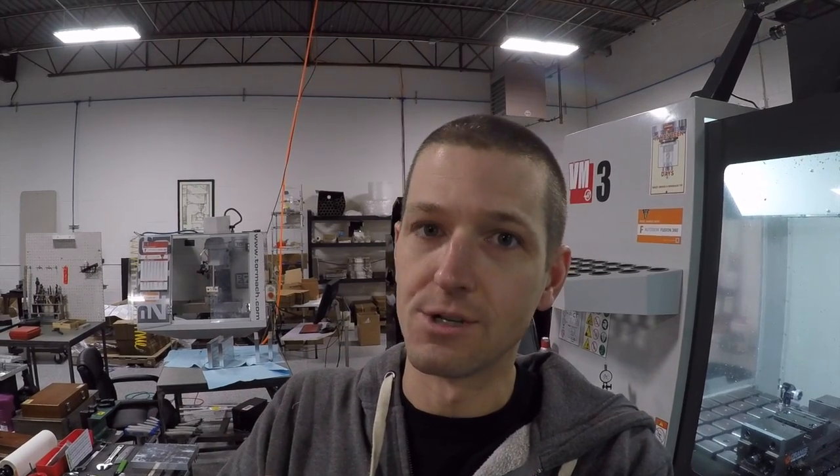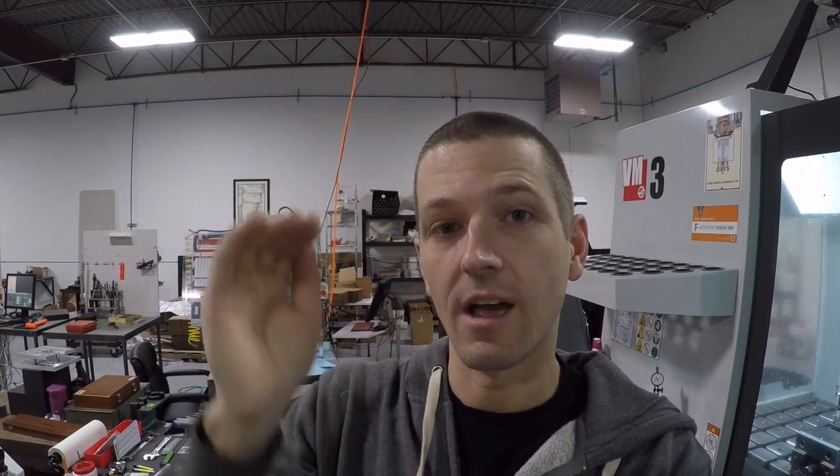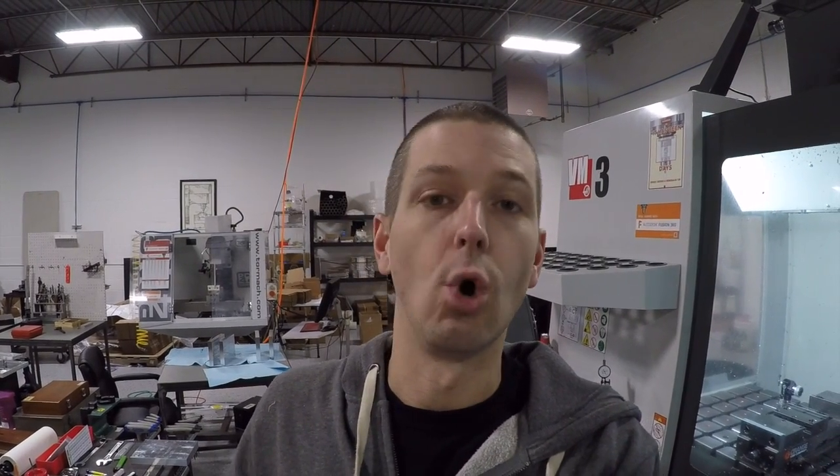Conventional machining — holy cow. This is like 101. This one I should have known; I did know, I just didn't think of it. There's a good video I found that you should all watch. If there's one thing I want you to do, hit pause and go watch the Sandvik video on thick-to-thin cutting and why you need to get underneath to let that cutter cut when you first take a cut. It's something we talk a lot about in our training classes — why you need to take a certain chip per tooth, don't rub, let the cutter do its work.